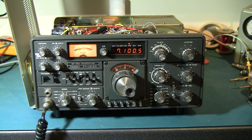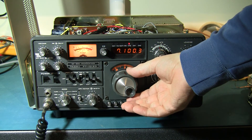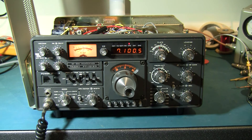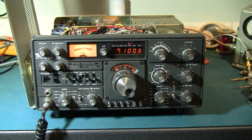But will it keep going? Last time I did this, before I modified the circuit, the oscillator stopped pretty abruptly and wouldn't start again until I warmed it up. I actually noticed this problem first thing this morning when I came in — the rig was quite cold. I turned it on and the oscillator didn't start, but after a short while it burst into oscillation.